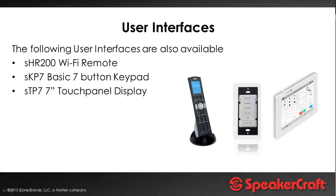We also have a hard button keypad — a single gang American back box. The seven inch is a double gang American back box; this is a single gang with four buttons on the front: favorites one to four, off, and volume up and down. Setting up favorites is very simple — set up the zone to do whatever you want from your iPhone or tablet, then press and hold favorite one and it will memorize that setting: Spotify top 100, Radio 1 via TuneIn on a Sonos, or the audio output from the Sky box. Then simply click to recall those presets.